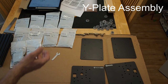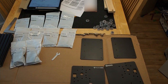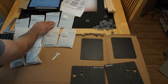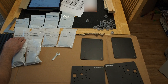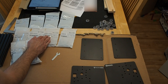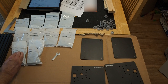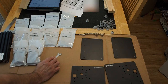It's time to do the Y plate assembly. The materials needed are the inner and outer Y plates, the precision shim used before, aluminum spacers of 6mm and 9mm, the eccentric spacer 6mm, M5 button head bolts of 16mm, 25mm, and 60mm, the nylock nut M5, nut blocks, the drag chain mount, the extrusion, and an 8mm spanner wrench.